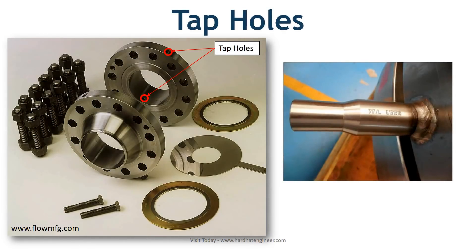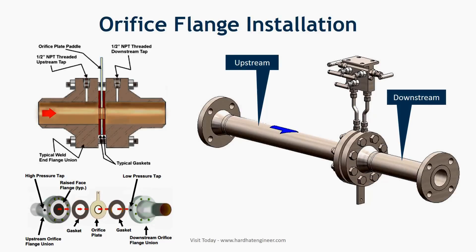A pair of pressure tappings, as highlighted in the image, are machined into the orifice flange. Note that these holes are directly opposite to each other. The tap holes are either tapped ½ inch NPT or ½ inch NPS socket connection. One tap hole from each flange is used to connect an instrument with tubing that allows liquid or gas to reach the instrument. The other hole is sealed with a plug.